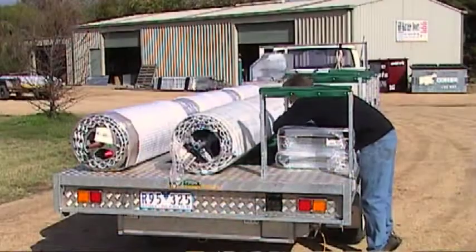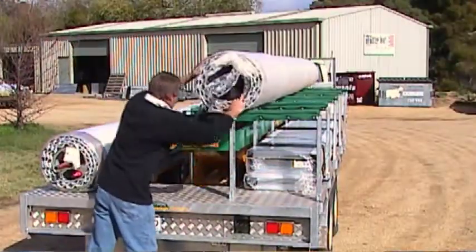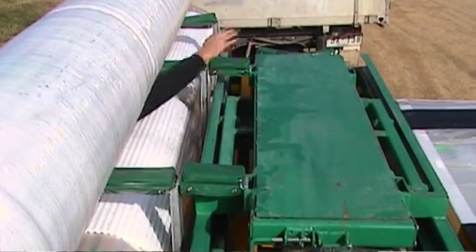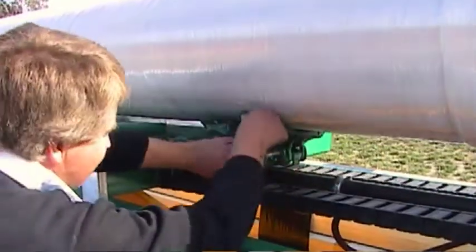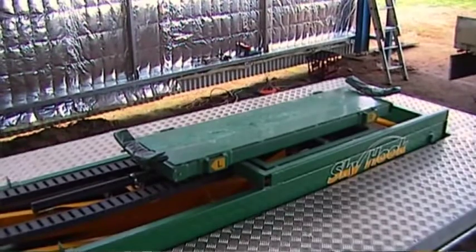The trailer comes standard with door hurdles which can be removed or positioned as required to allow for the transport of up to five full-sized domestic doors. The small hurdle bridges allow the doors to be moved with ease from a stored position on top of the door hurdle across into the Skyhook cross slide safely and with ease. The door cross slide is mounted to the top of the in-out trolley and securely holds the door whilst manoeuvring it into position.